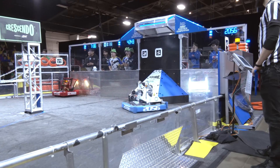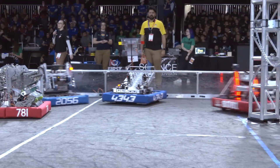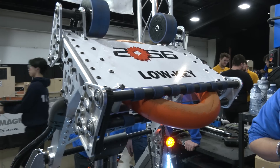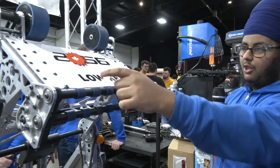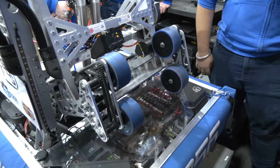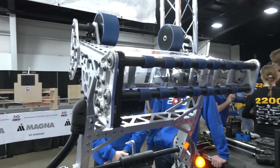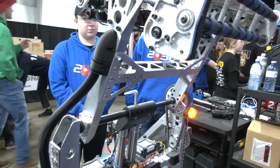The construction of the shooter is a top and bottom plate made of polycarbonate with formed aluminum C-channel — about one-eighth inch aluminum. This whole structure pivots on a gearbox, which is how we do our amp trajectory. It's a single pivot, single handoff, and it shoots directly into the amp — extremely nice trajectory and we almost never miss because there's nothing to bounce off. Have you gone up against tall defenders? With this arm, from specific positions on the field, we can set the arm angle to a high position. Even bumper to bumper, a four-foot defender — we shoot right over them into the speaker. So under defense, it gives us a lot of opportunity.